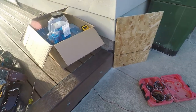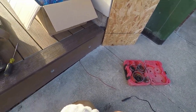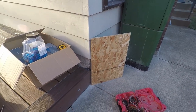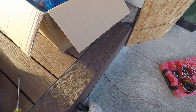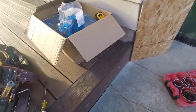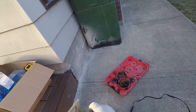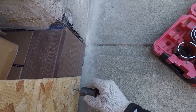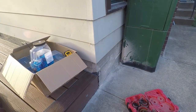Here's the wire. So if you were to just take your hole saw and drill a hole in a flat surface, it would be fine - the center pilot holds it straight. However, if you try to drill a hole at an edge or corner, it can walk all over the place. So what we're going to do is drill a pilot hole through a piece of plywood, then hold the plywood where we need it, get the hole saw started, then move the plywood and finish the hole. Everything is good to go.